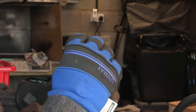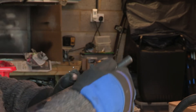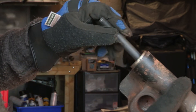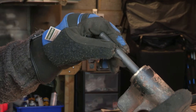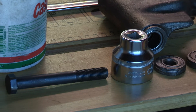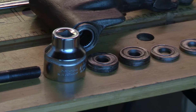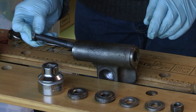Let's try it that way around. We could be on to a winner with this — let's find out. The bolt's a half-inch UNF thread, which is the same size as the original shaft. That means I can use the otherwise scrap thrust washers and some of the nuts from the original setup.